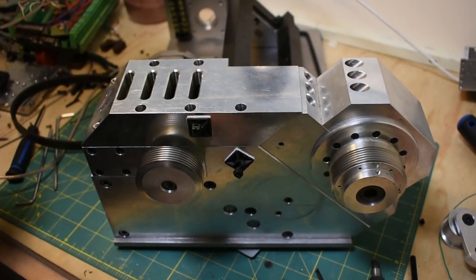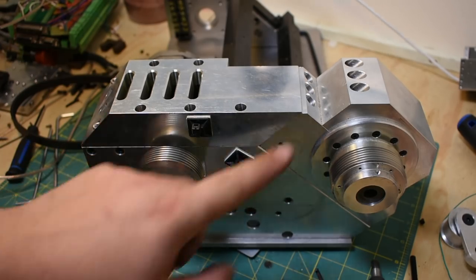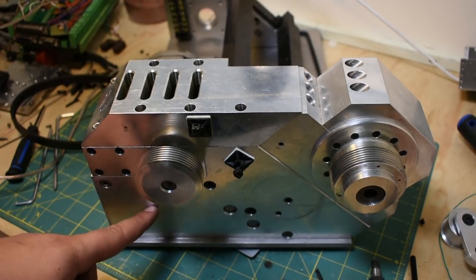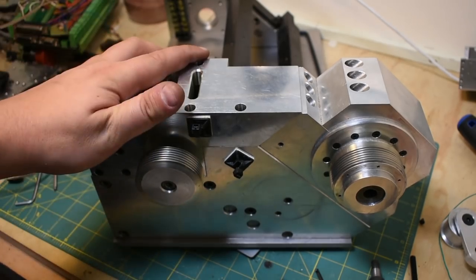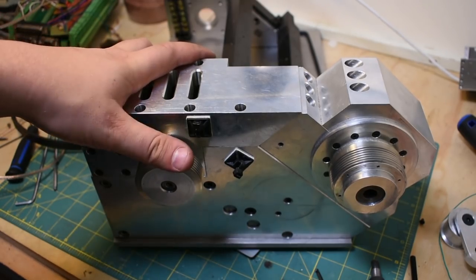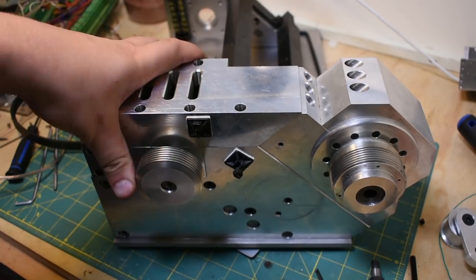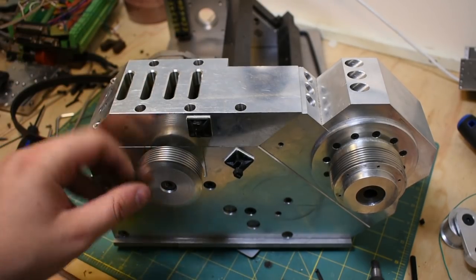So you can see I had sort of the fundamental problem of getting the motor shaft down here connected to the drive pulley up here. What I had originally done is actually geared up the pulley because I really want to hit 10,000 RPM on one of these. Kind of a silly personal goal. What I found out is that when you gear a system up, you lose a ton of torque at low speeds. It's all right to have low torque at high speeds because there's inertia, and cuts are lighter per revolution, but at low speed especially, I wasn't able to cut anything.